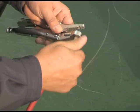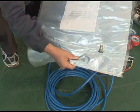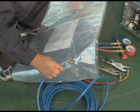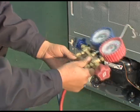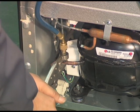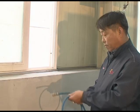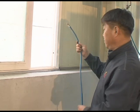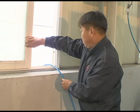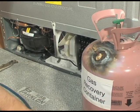I'll explain about removing refrigerant. Prepare the manifold gauge and connect both side hoses of the manifold gauge to the pinch pliers. Connect the center hose of the manifold gauge to the refrigerant returning bag, making the refrigerant returning bag flat. Open the valve of the manifold gauge. Pinch pliers should punch at the sealing pipe, dryer auxiliary pipe, and discharge refrigerant for more than 10 minutes.